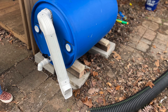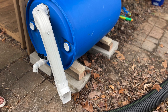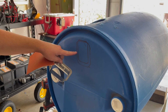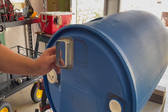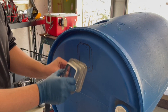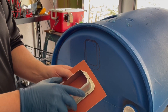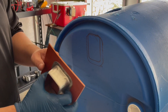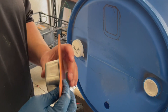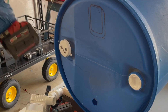The next thing you need is the barrel overflow. The reason I wanted to do a barrel overflow is I've seen a lot of rain barrels where you fill up to the top and then whatever's left just gushes over the top and runs down the side of the barrel — but that means your gutter is not discharging water away from your home or structure. It's just pouring around next to the barrel, which can eventually lead to foundation damage. So you're going to want the overflow. I went ahead and found these fittings for a gutter. This doesn't have to be watertight — it's not a pressurized system.